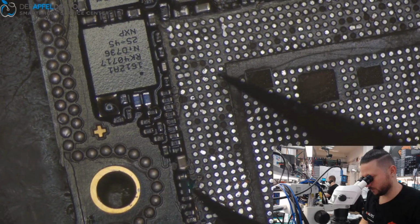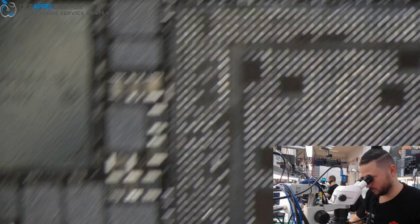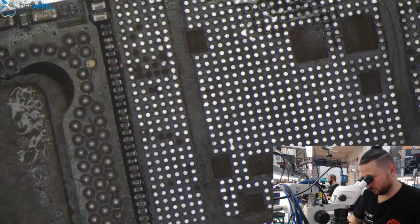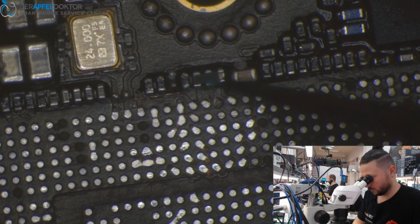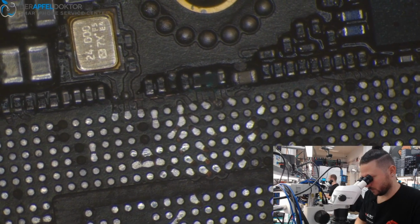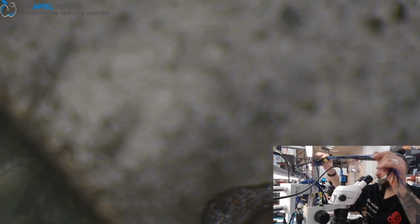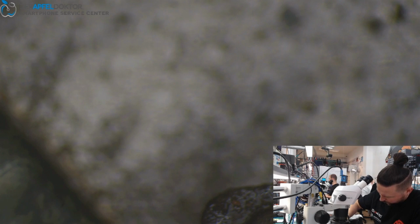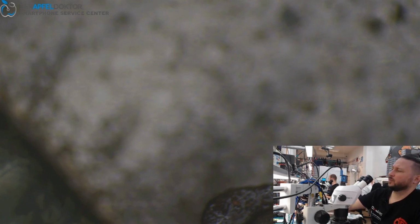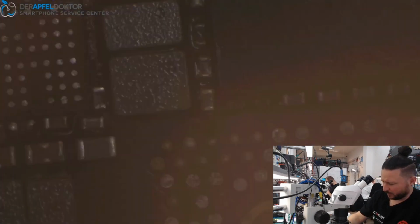Okay, much better. Control the edges. Now it looks good. The jumper sits good too. The rest is okay, clean. Check the value at the power supply to see if the board is fine. Board is fine. 4 milliamps with NAND, without CPU. Okay, get it in here.